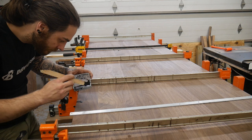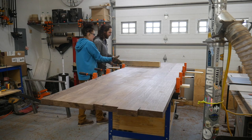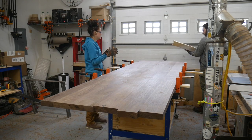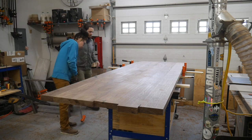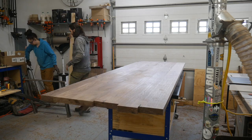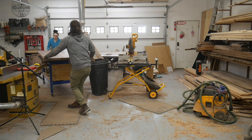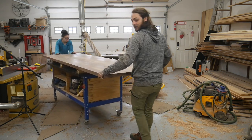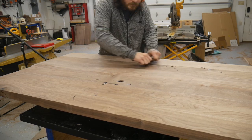We didn't want to stress any of the joints, and I just filled any knots, voids, and whatever with this black epoxy. I never want to let a tabletop like this rest flat on a surface, so we just prop it up with 4x4s so it's not sitting on the surface — that's a great way to get your tabletop to cup. It could be out of the clamps flat but if you don't take care of it it will end up cupping or warping. Sawhorses or anything would work — I just don't like setting it flat on a surface where it can't breathe.